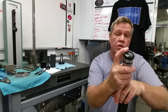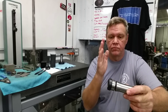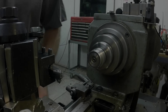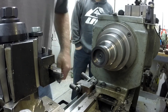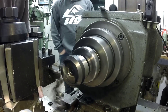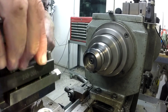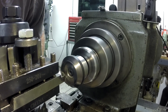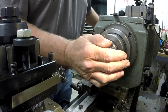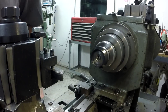That was our third op — getting one side of these things correct. Now it's time to leave the same rig on there, flip them, and cut them to width while doing our final bevel. We're going to index it on the collet, using a little Teflon block to make sure it's seated all the way down. Now I'm coming in with a chamfer tool and hitting a hard carriage stop. Then I take a separate facing tool and face it from the inside out so it doesn't pull the burr on the inside. Then I flip and go back to my chamfer tool, hitting the same stop to ensure that both chamfers are equal.